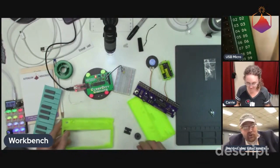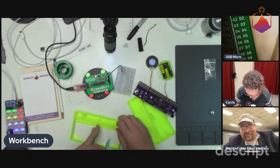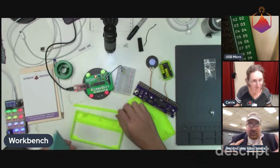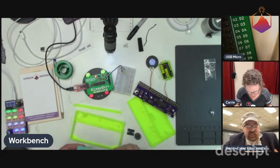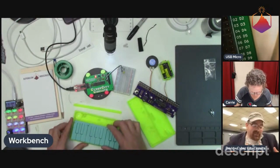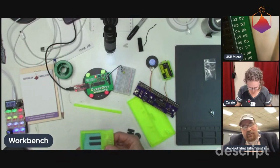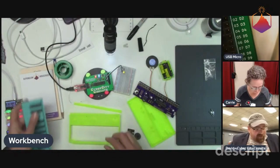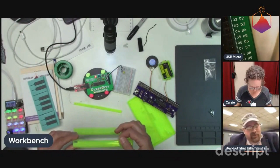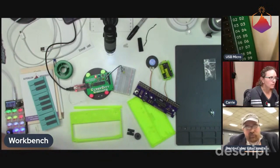The reason we charge a consignment fee per piece of cut tape is because we had a joker that sent us like 10 pieces of cut tape for the same part. You have to have a special machine to splice cut tape together, and that machine takes time and can be very frustrating to work with. So we charge $5 per piece, and then it has to be loaded into the machine. The fastest we could do is 3-5 minutes per line, and that's if nothing goes wrong. So we charge a consignment fee per line, and then we charge markup if we buy stuff.